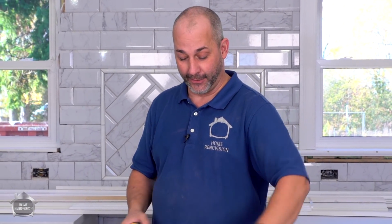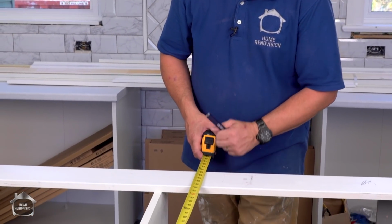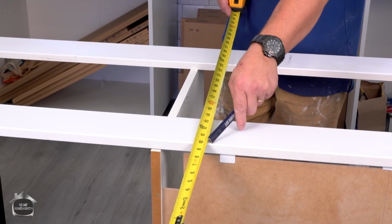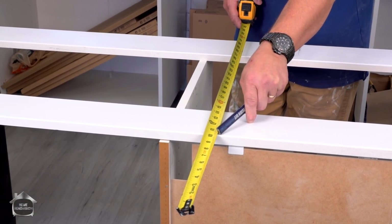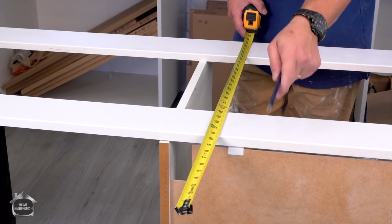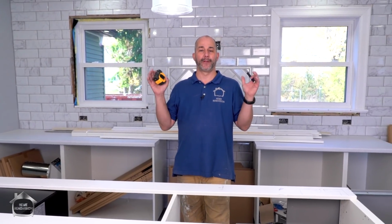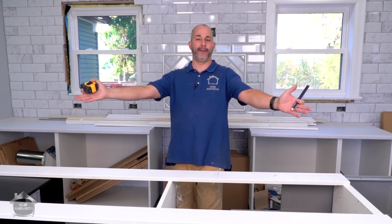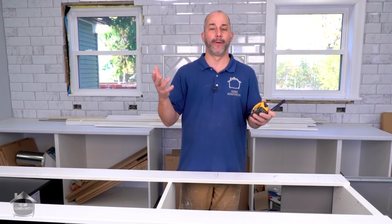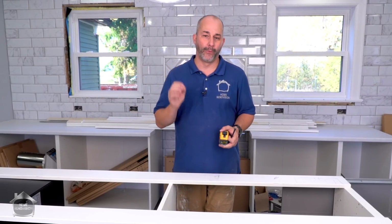So your countertop is basically going to be 24 inches, plus 1.5 inches for overhang on this side, plus you want to have at least 10 inches overhang for your eating area. Okay, 12 is better, but 10 is your minimum so that you can sit at the counter on a stool comfortably and eat. The other thing you want to consider is how many people are going to be sitting at your island. With 9 feet, you can go with 4, but sometimes 3 just looks better. Remember, 2 couples in a kitchen, 3 in the chair, 1 hosting, that really works well.